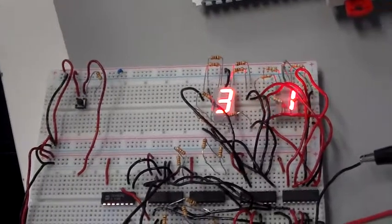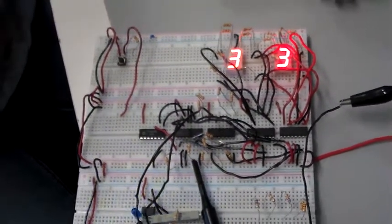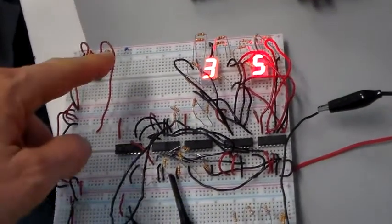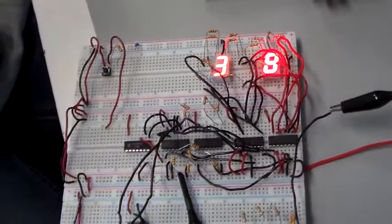And it has, like you see here, a really profound effect on the performance of the circuit. You will often find digital circuits with decoupling capacitors sprinkled throughout the circuit board in parallel with all the DC power lines.